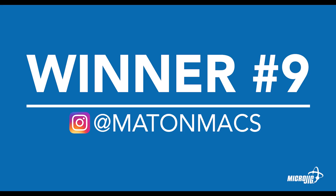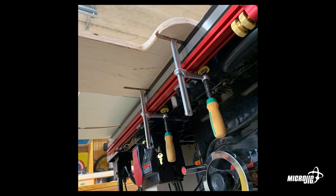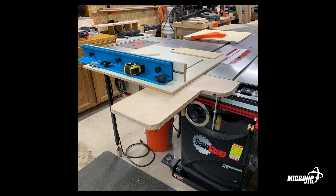Met and Max — it's a good, easy, and simple way to build, and it's very effective too. When using our tapering jig and you want to make a longer cut than about 36 inches, an infeed table will allow you to do that with an extension on the saw fence itself, and something like this would be ideal for that.